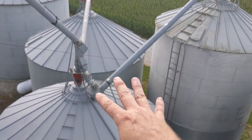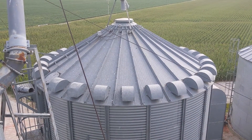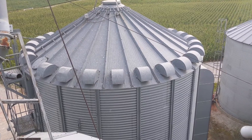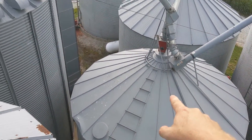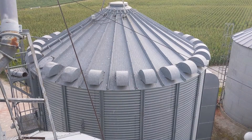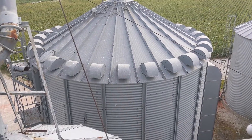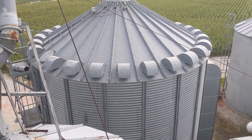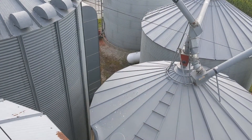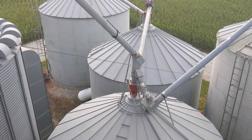Our big bottleneck during corn harvest is the dryer. We eventually catch up, fill the wet bin, then have to dry corn and run the dryer empty until about 10 o'clock the next morning. My thought was take four out and build another top dry. What's nice about the top dry is there's a chamber in the top which dries the grain, but it's also eleven thousand bushels of storage when done. With a continuous flow dryer you're just drying - there's no storage. So you kind of get a two-for-one deal - take out four, build another top dry for more drying capacity, or maybe add a tower dryer.